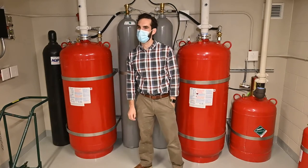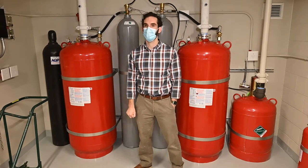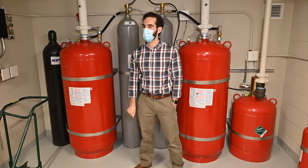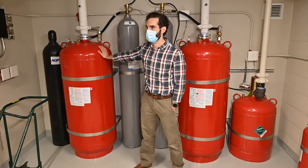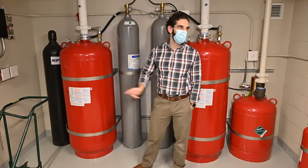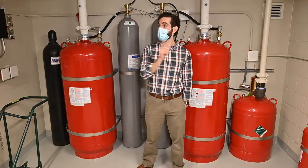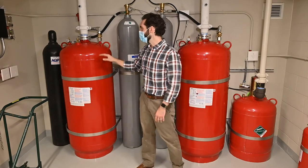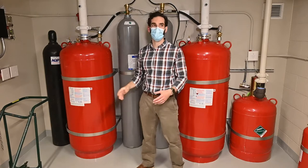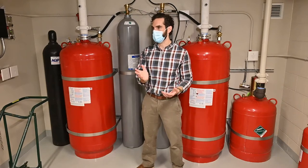I thought one of the requirements was that a sprinkler head goes off at a certain temperature — so two different things have to set off the pre-action system? Two smoke detectors — a regular smoke detector and the VESDA smoke detector for the clean agent system. But will it do both? VESDA plus one smoke only sets off the clean agent — not the sprinklers. But you now have your first smoke for the sprinkler, so if for whatever reason the clean agent doesn't put the fire out and your fire continues to grow, another smoke detector going off in the space will open the pre-action system valve and get water in the pipe.